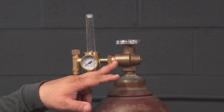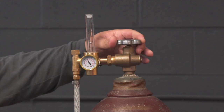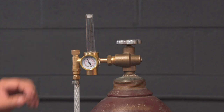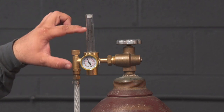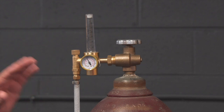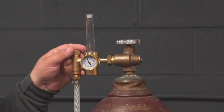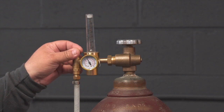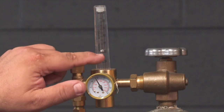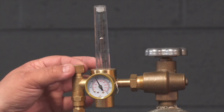This style flow meter attaches to the tank the same way that the regulator attaches. This gauge will show your tank pressure as you open it all the way up, and you see a little ball floating in here. The ball will indicate the flow — the only way you can read flow is if you have the hose in your hand or if you pull the trigger on your MIG gun and actually let the gas flow. Here you see a scale printed on there from 10 to 60 CFH. For MIG welding you want to be at about 20 or 25 CFH. This would be 20 — you're reading the bottom of the ball floating. 25, 30, and so on. You adjust your flow here.